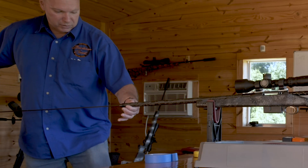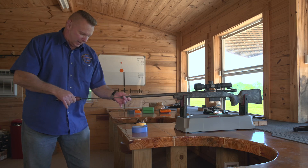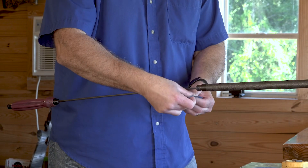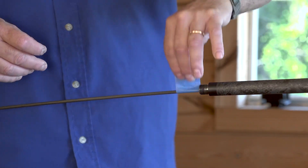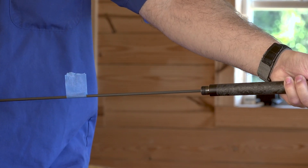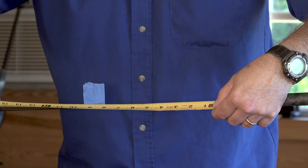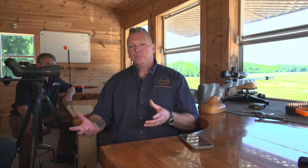Barrel twist is very important. If you don't know what your barrel twist is — you bought a gun, you've had it for 5 or 10 years, and you can't get the information from the manufacturer — it's pretty easy. Take a cleaning rod, run it down the barrel from the front to the back with a nylon brush until it stops. Pull it back until the brush engages the rifling. Take a piece of tape, put it right up against the muzzle and put a little flag on it. Start pulling the cleaning rod back — make sure it has a rotating handle — until the flag does one full rotation, then measure from the back of the flag to the front of the barrel. You'll see if it's an 8, 8.5, 9, or 10 twist. It's not the best way, but it gives you a pretty good idea of what your barrel twist is.